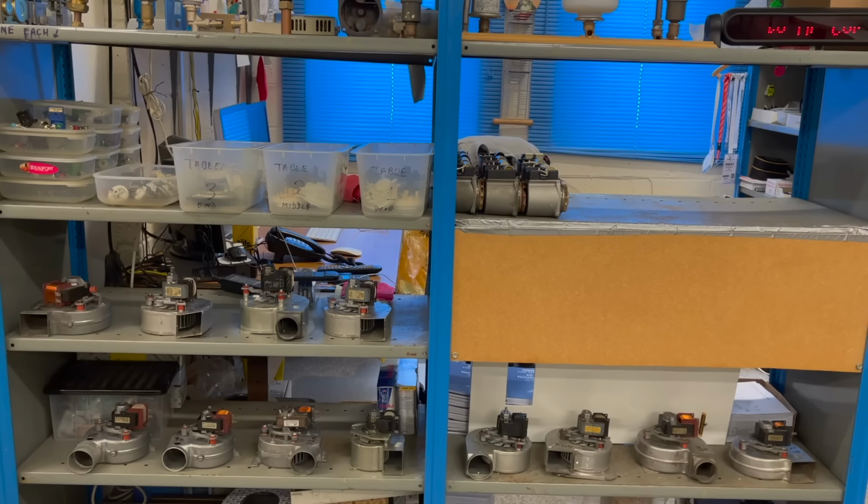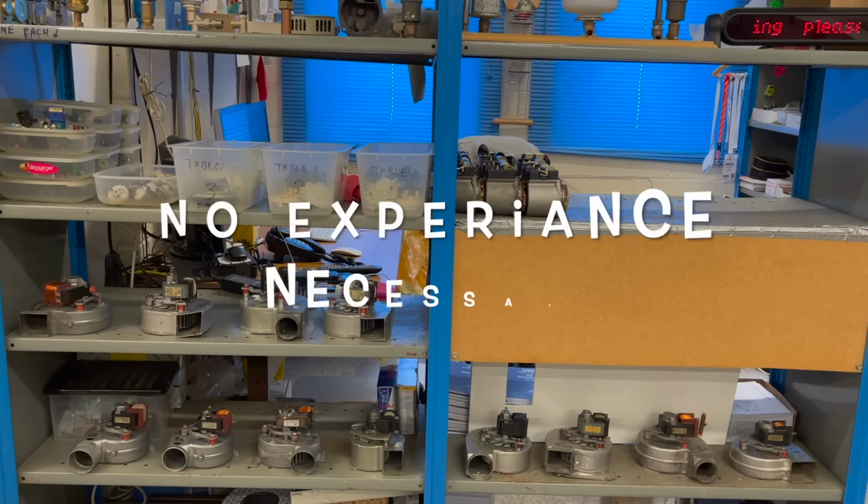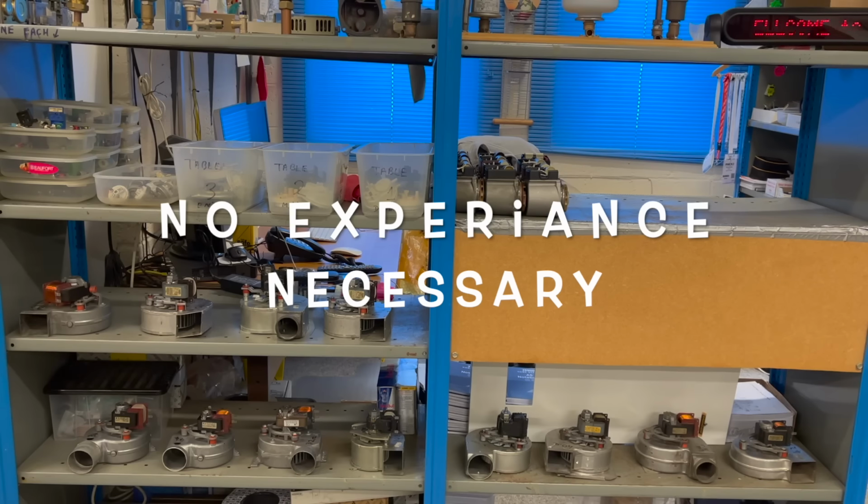If you want to repair boilers and do diagnostics, which is in huge demand, you need a hands-on course, which we've been doing here since 2002. And it's compulsory to learn how to use a meter and how to test components in a sequence. At the moment, we're going to show you how to use that multimeter to test the fan. But you also have to learn pumps, fan sensors, stats, and all the other components that make up this particular boiler that's fallen over and we need to fix it correctly.